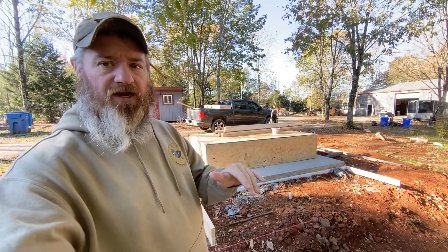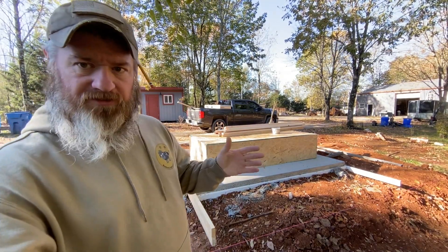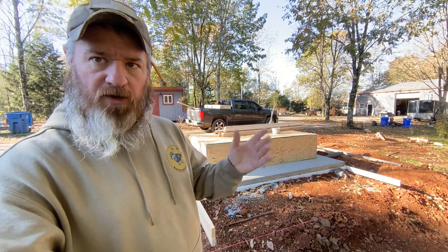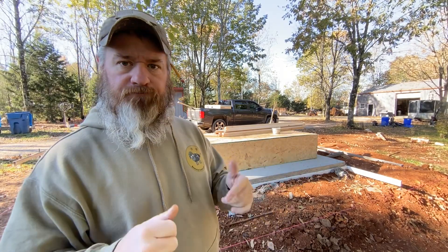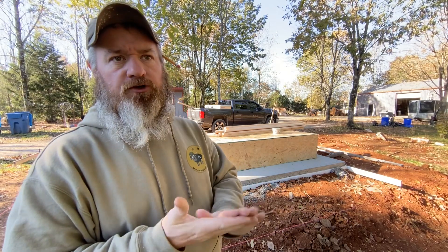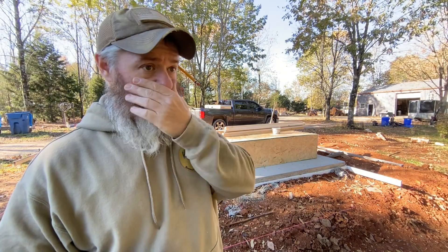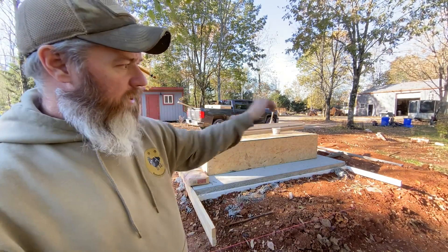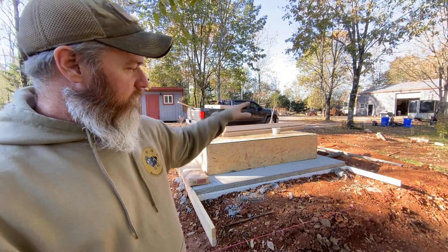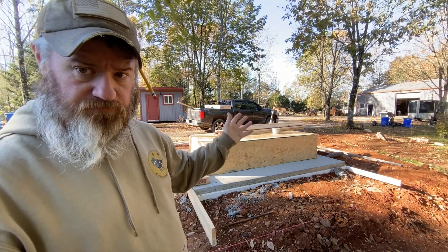What we've got so far is a concrete pad — a seven-foot wide, ten-foot long center slab. From the edge of that concrete to the edge of the greenhouse we're going to put creek rock for drainage. I wanted the center to have a concrete base. I did a little grade work to halfway level the site since the yard sloped, brought in some dirt, loosely packed it, then poured my slab.